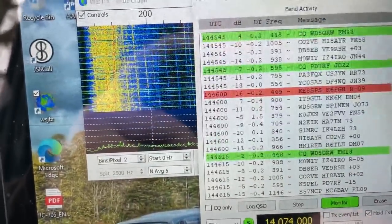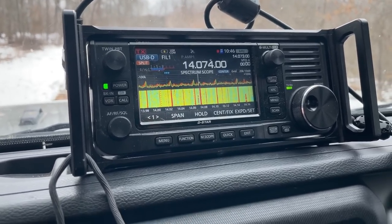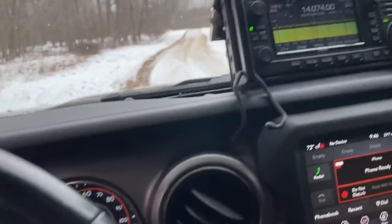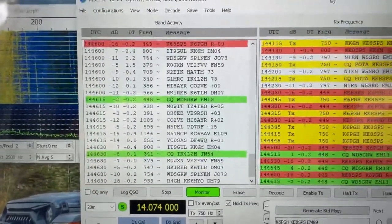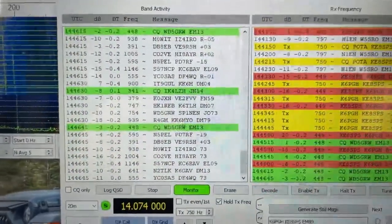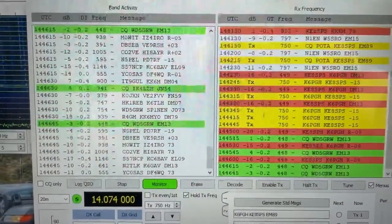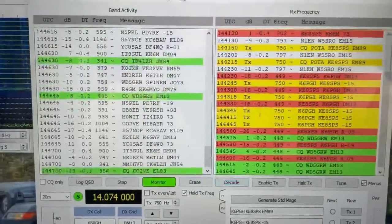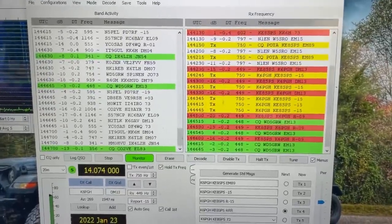All right. Now, I've got my radio up here. You can see there's a lot of noise in that thing right now, and it's coming from my laptop being charged off of an Anker brick over here. That's why the noise, but I'm getting signal through the noise, no problem. That's part of the beauty of this system, is that you can send signals out, and FT8 can dig those signals out of the noise. And so it's a digital mode going over radio waves. There's no internet hooked up to it. No satellites, no nothing. It's completely off the grid once the software is loaded onto the computer. And that's the caveat. You have to have that piece of software to encode, decode that text from the radio waves.